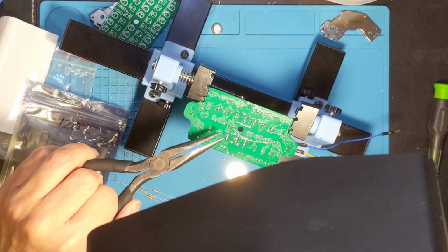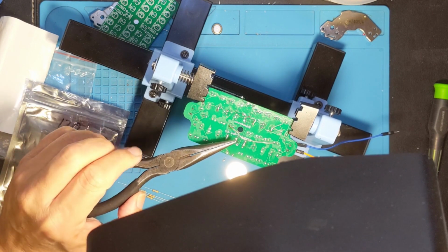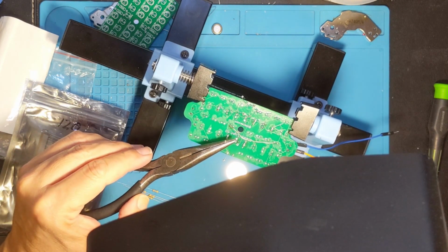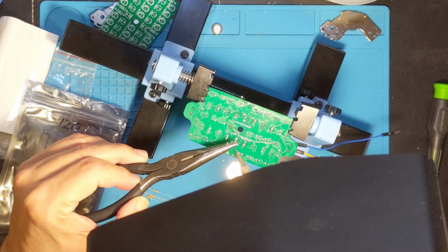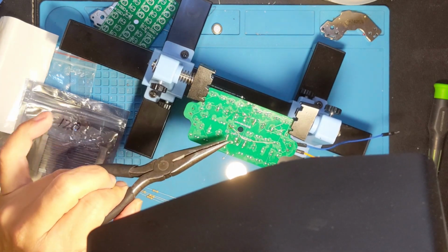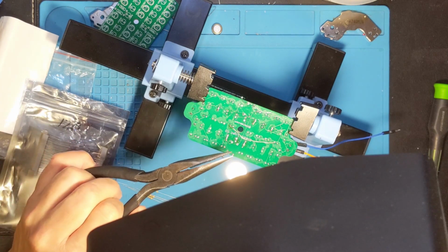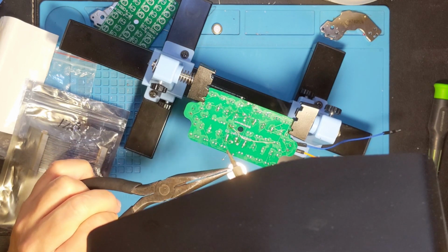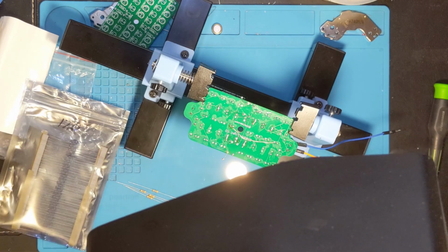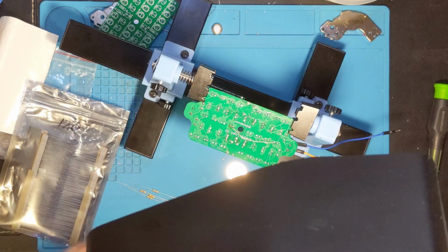All right, I got mostly through here. I had to push a couple of them through like I did with the LED. And I don't know if I can really recommend that technique because you really could burn your fingers. I had to hold the resistor by the body and try not to overheat the leg and still get this down here to melt enough. I actually pushed from the other side. And then you got to pull them through with something. I just use a pair of pliers.